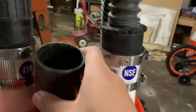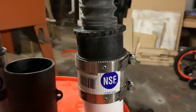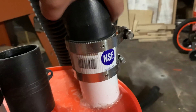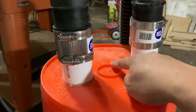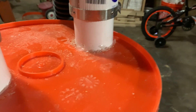To fix the problem with the port sizes, I picked up these rubber couplings from Home Depot that work with 2-inch diameter PVC, and these work great for my hoses. Here you can see I avoided the hole in the middle and moved it to the left for my shop vac, and I left the hole on the right side a half inch from the edge, just like Chris recommended.